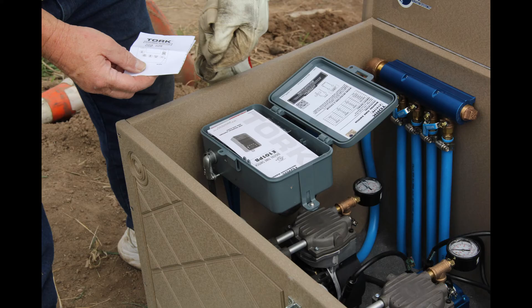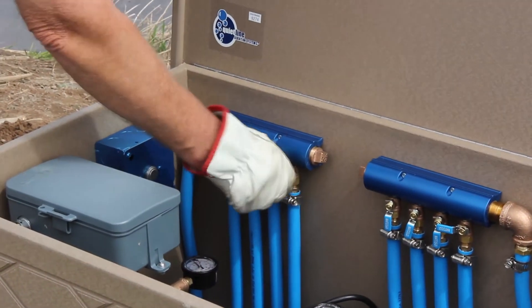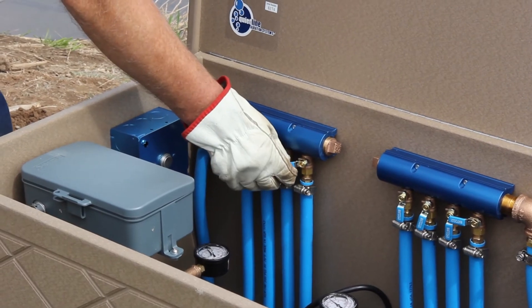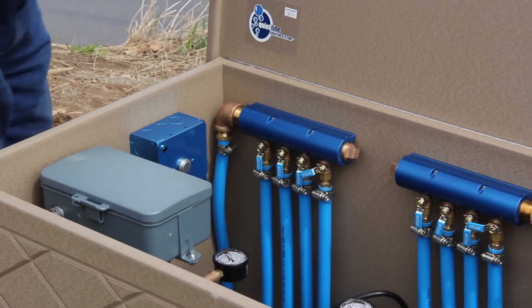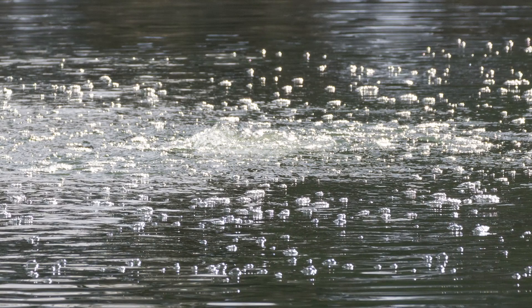When you turn this on, it will take some time for air to reach the diffusers, so be patient. Once you see bubbles coming up from all of your diffuser locations, you may need to balance them out to ensure the proper amount of air is going to each diffuser. Typically the most air will be coming out of your closest and most shallow diffusers. You'll need to balance the system to force air to the deeper, longer diffuser runs. This can be done using the adjustable manifold inside the aeration cabinet.